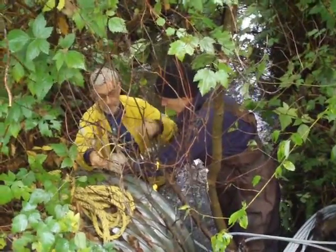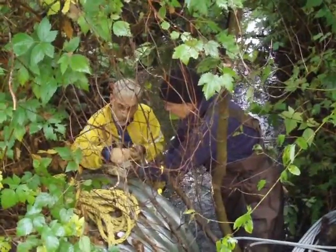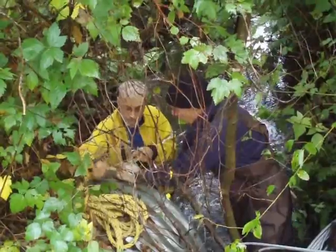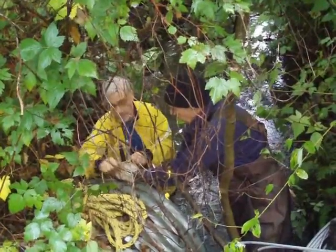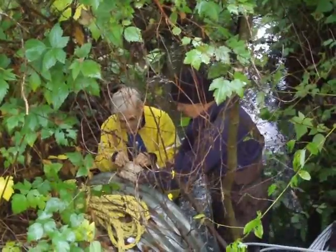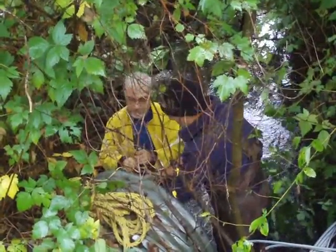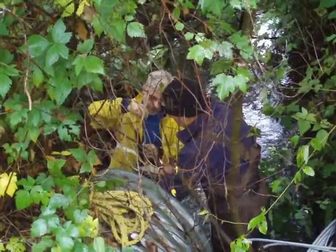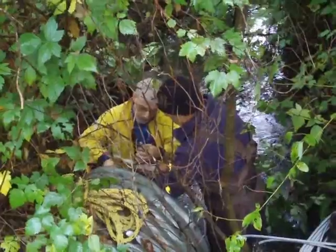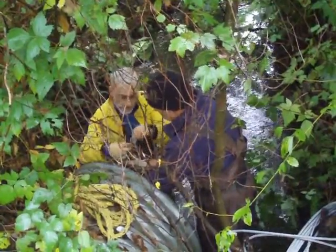The plan now is to tie a steel cable onto a six-foot crowbar and then Jim can crawl up the culvert and poke it through the dam. At that point we'll tie a smaller crowbar on the end of it and start pulling backwards with the come-along to try to pull the dam out and blow it out the bottom of the culvert.